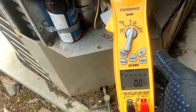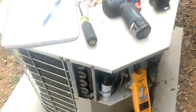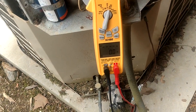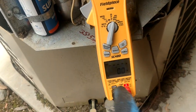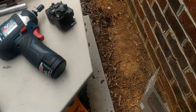I have the meter set to volts and amps, and I have pushed the inrush button one time to activate inrush. The decimal point is in the middle because I'm assuming this is going to pull somewhere under 100 amps. I don't really have any kind of reading to go by here since the panel information is gone. But this unit should probably pull under 100 amps. On these Field Piece meters, if you're pulling above 100 amps — like 154 or something like that — you need to go ahead and hit the inrush button a second time to move that decimal all the way over to the right, and then you can take a much higher reading.